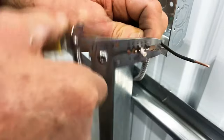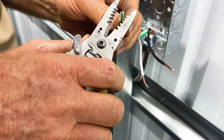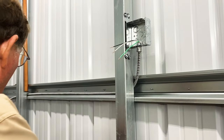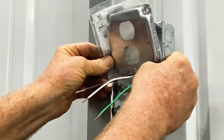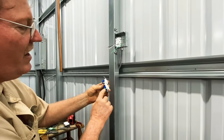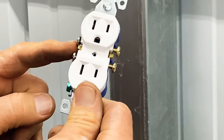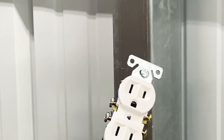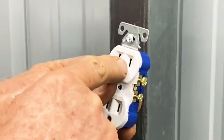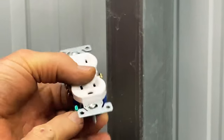Get about a half inch to an inch — you always can cut more off. Here's your ground. I'm just going to put a regular plate on here. Okay, these two types of plates: you got your ground. Notice these are silver — when they're silver, that is the neutral side, which neutral is white. These are gold. See how there's a small end and big end, and then you got a ground; the ground's down here.